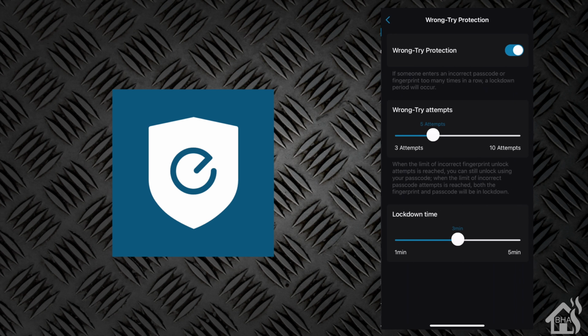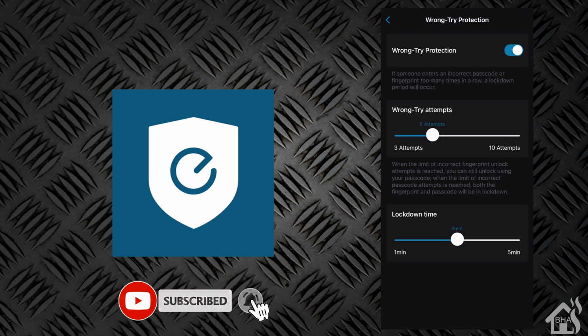Wrong try protection. Again, this is enabled by default. I think it's a pretty good one to have. It's set at 5 attempts. Basically, if you type the password wrong 5 times, it will lock out for 3 minutes. And you can play around with that setting if you want to increase the number of tries or how long it's locked out. You certainly have the ability to do that here as well.